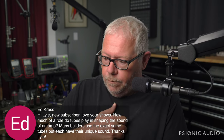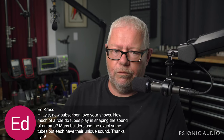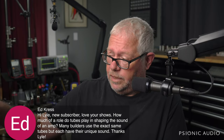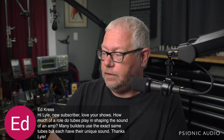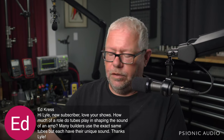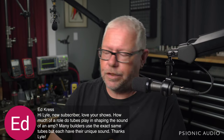And so the Fender has a certain response. The Marshall has a different feel. To that player, the only real visible difference from the outside is, oh, that's what 6L6s have. Therefore, 6L6s sound like this. That's what EL34s sound like. So yeah, that's what an EL34 sounds like with this primary impedance on the output transformer, with this plate voltage, with this negative feedback setup into these pre-Rola Celestions, in this room. That's all these other factors that interact with the EL34.